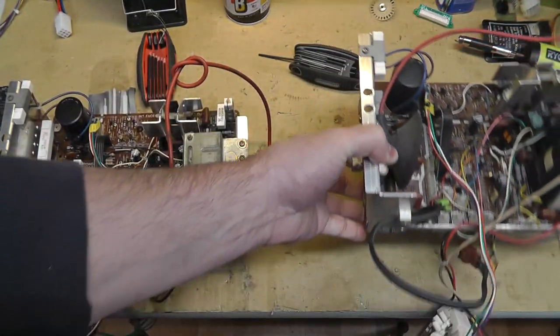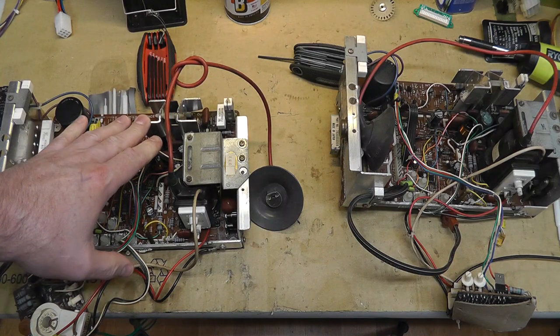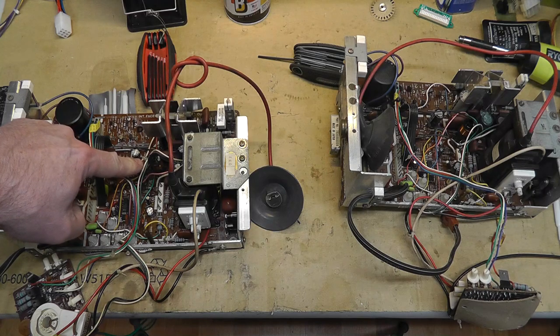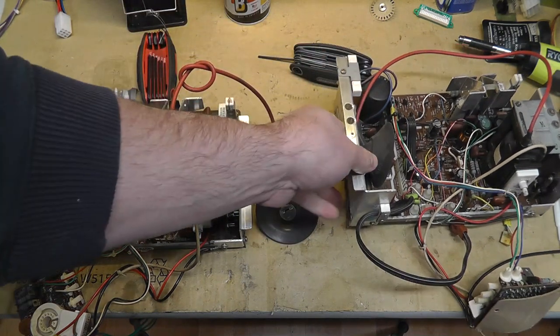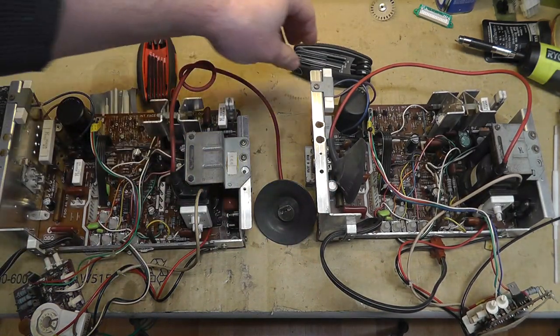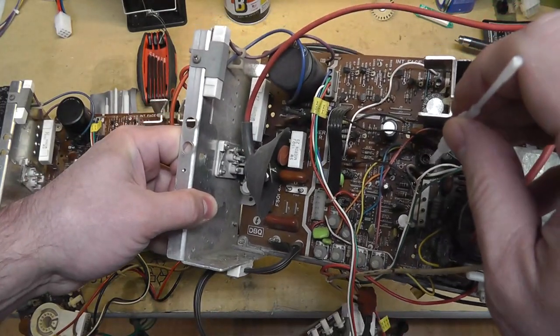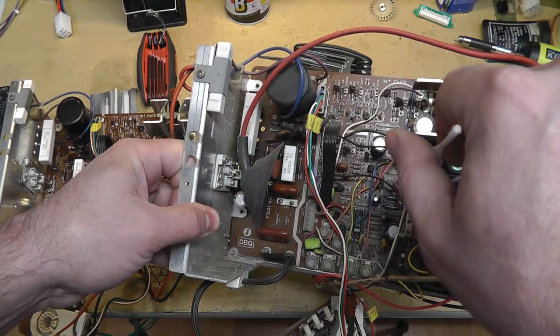There's two options I was going to do. One is I was going to use a 0.10 microfarad width cap to try to make the image bigger with the existing width coil. But since I have a width coil that's actually adjusting with my adjusting tool, and it feels like a metric Allen wrench is the right one. See, I can actually turn this thing.